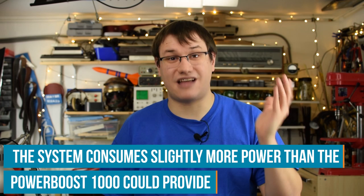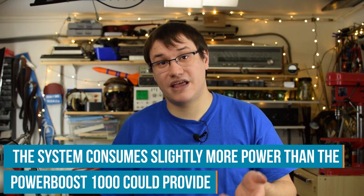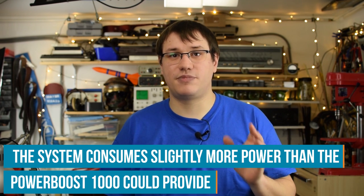So I tried it out, everything seems to work fine, but the moment you activate the shutter of the camera, it shuts down the Pi under voltage. So that's just not beefy enough to power all the things. But I haven't had more space inside the device.